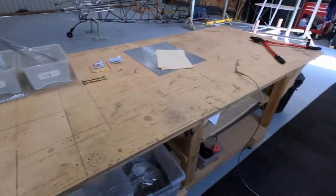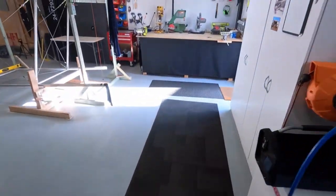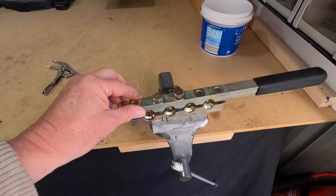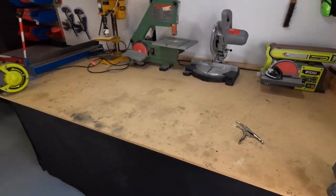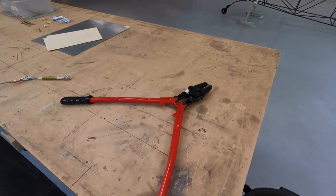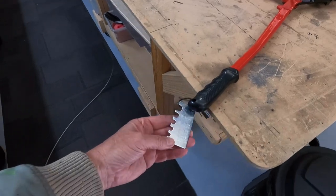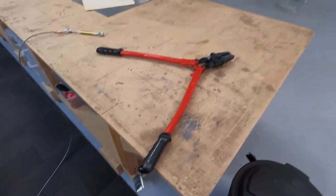Got the book out. Just crimped this cable up. Now I use the Aircraft Spruce swaging tool in the vice — it seems to crimp them down nicely. But I went out and bought myself a bigger pair of crimpers specifically for the 3/16th cable, with the correct go/no-go gauge as well.